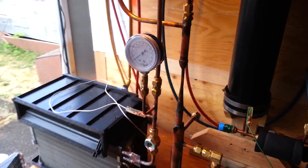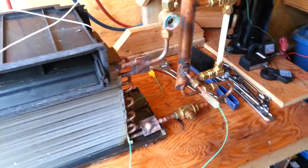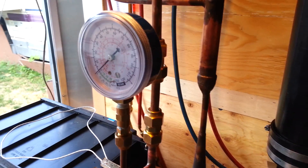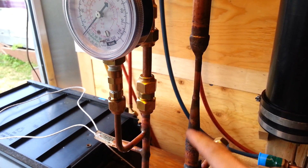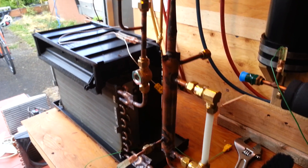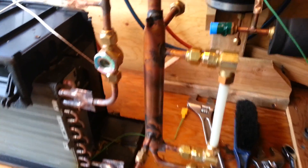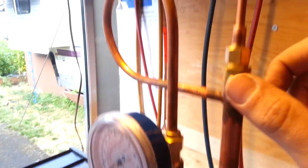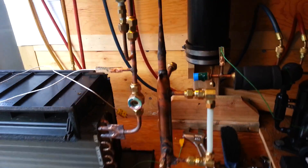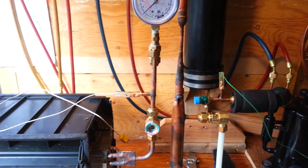Now that I have the good portion of the ejector system actually assembled — haven't tested yet, just did most of this work in the last two days. The ejector assembly, the main ejector I discussed earlier in a previous video called 'ejector refrigeration,' I am going to be firing this thing up probably tomorrow. I only have two connections yet to make: the suction back to the compressor and the high pressure liquid coming into the main throttling valve. Now that it's mostly assembled I thought I'd make another video explaining what I hope to happen.